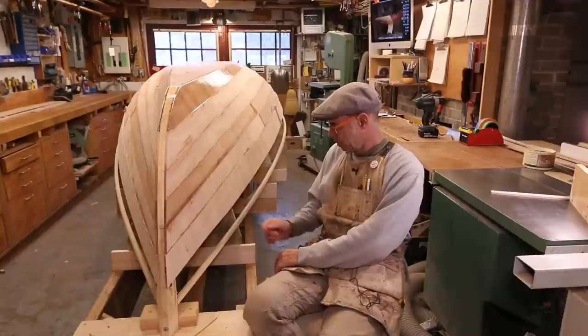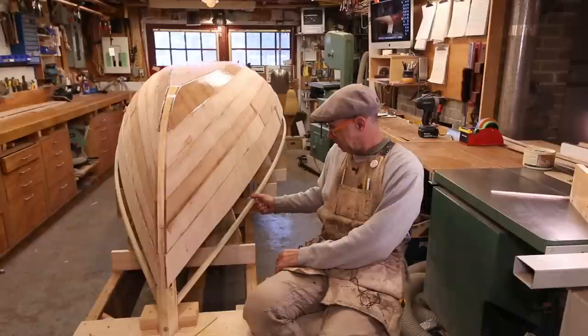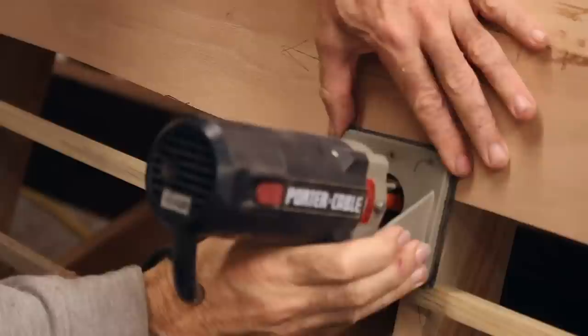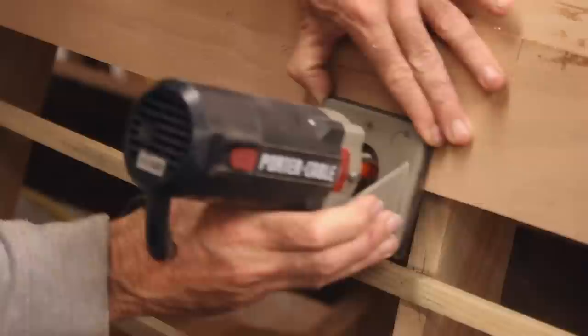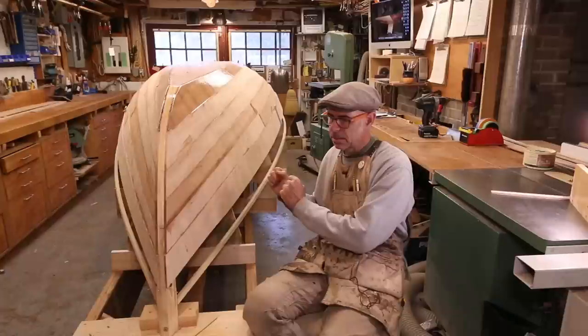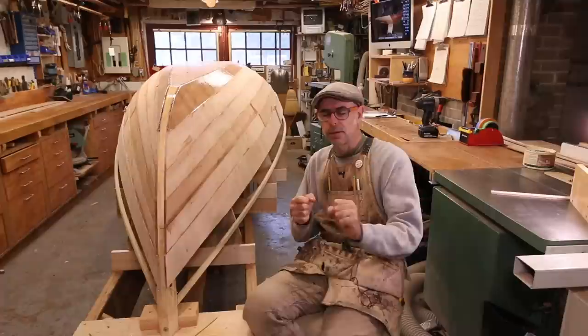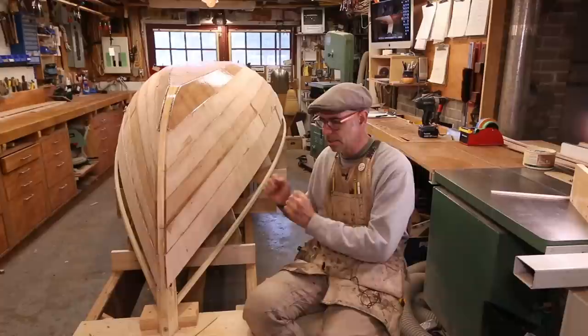The routing is a little bit slower because of that, but not a lot. The battens want to flex a little bit, and by the time you're running the router along the batten you don't want a ton of material coming off the plank because the router wants to bite in harder and it'll pull. So I use this technique where I work backwards, doing a climbing cut with the router enough times that I reduce the final cut down to like an eighth of an inch — then it runs much smoother. A climbing cut by its own nature doesn't dig in deep because the cutter is rolling outwards instead of inwards. It's more dangerous in a way, but not so much with a small router. With a big router it can run away on you very easily, but with a small router it's easy to overpower it and control your cutting.